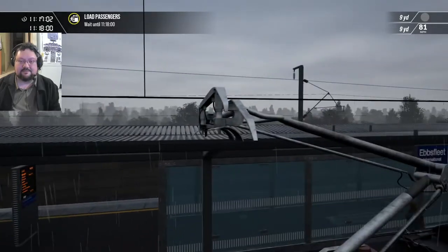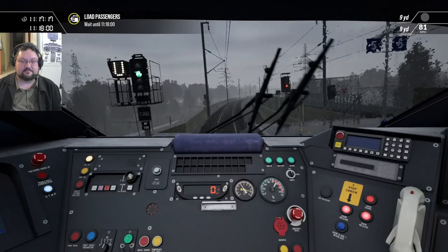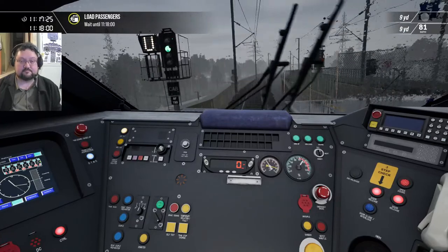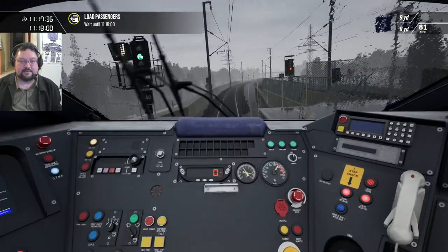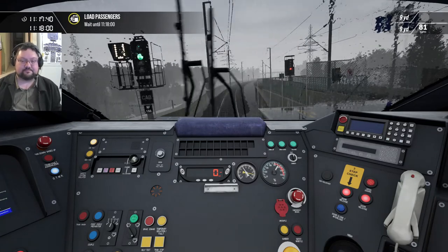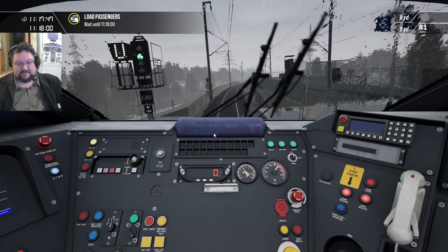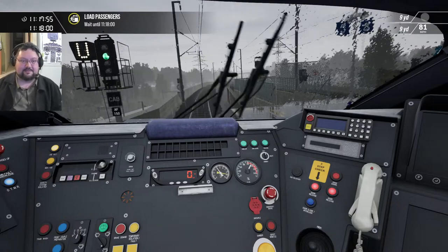There it is. That's where all of our power's coming from, instead of that little third rail down there. The shoe is raised. CTRL light is in. And soon we go underground. We're now in kilometers per hour, and in a little while we pass over one of the magnetic strips that starts to activate our, essentially, autopilot. It's not a complete autopilot, it's more like a target this speed kind of deal.